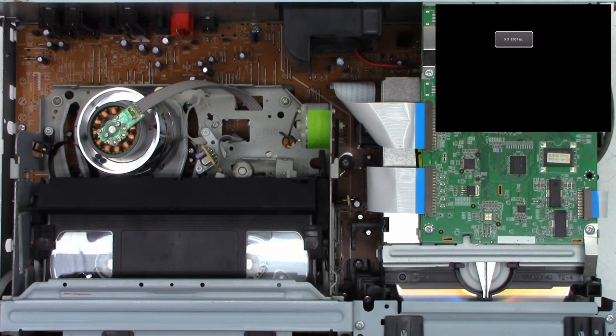I think that one's okay at 47. And 1 ohm on that 330, I would like to replace that. So 1, 2, 3 of the 330s and 2 of the 100s, and all the rest seem to be perfectly fine. You know what? I'm just going to take a chance and go ahead and replace these guys. We'll service the optical pickup. Basically, just clean the optical pickup that lives up underneath here. And we're just going to make this customer happy and hopefully get many, many more years on this unit.